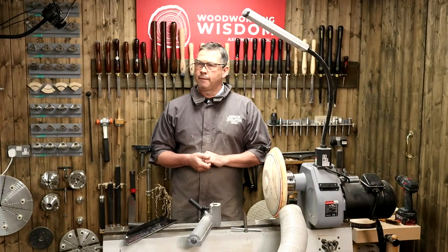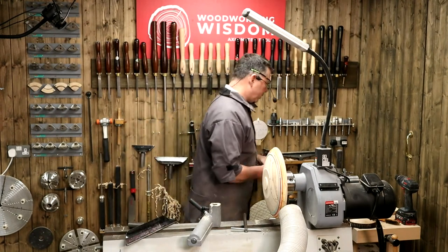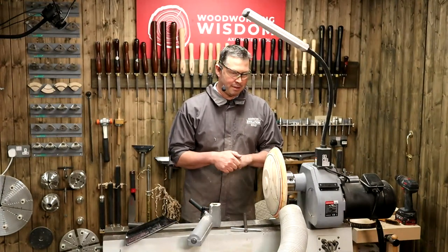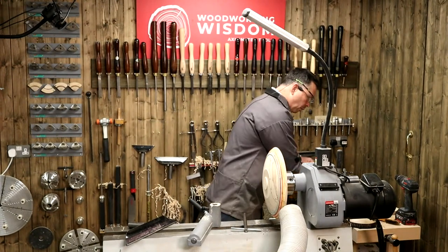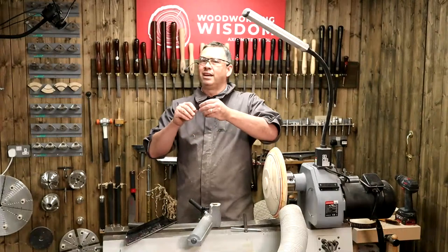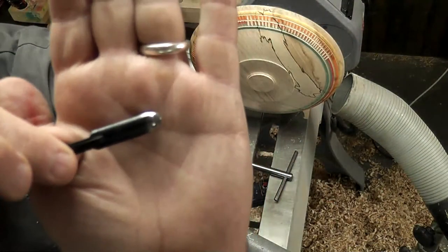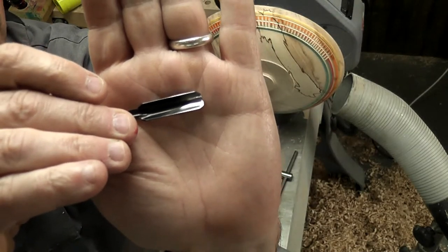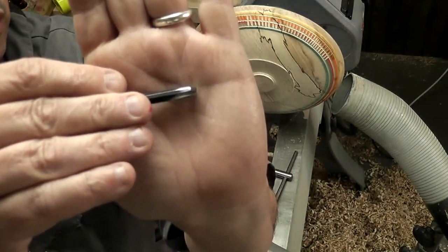All right. And then Fuller's asking, how often does the reciprocating chisel need touching up or sharpening? The minute it starts to dull. You know what I normally say, keep things sharp rather than let them go blunt before you resharpen. I would say the same with that. On this one, Fuller, if I can hold it up, we've got a very, very polished back surface. So they are honed on a polishing mop with honing soap once we've got that initial cut.